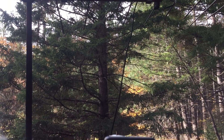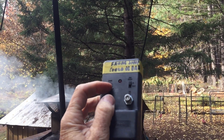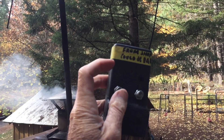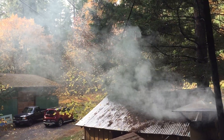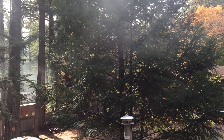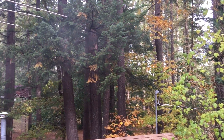I actually got the other half of it to work a little bit by turning this little potentiometer inside the hole back and forth. I've seen this before where this thing gets like a dead spot in it — sometimes you just turn it back and forth and that'll be enough to get it to work again. It's almost like a volume control that gets static in it and you need to spray an electronic spray cleaner lubricant in it just to get it going again. Anyway, I think we got her going here.